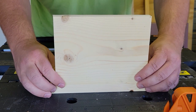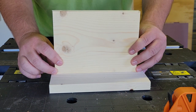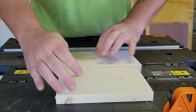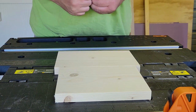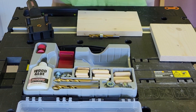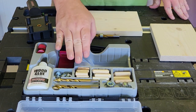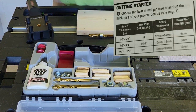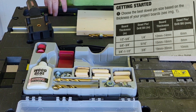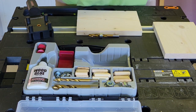We have instructions to do corner, surface, and edge joints, and I will go through the instructions on how to do all three. The first step is going to be determining which size dowel to use. They've got a quarter inch, five sixteenths, three eighths. There's a chart that tells you which ones to use. Our boards are three quarters of an inch, so we're going to use the five sixteenths.